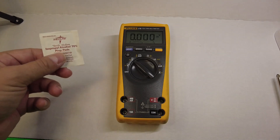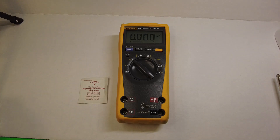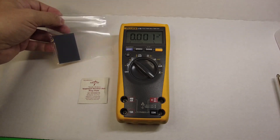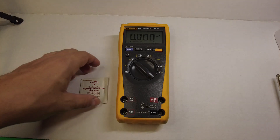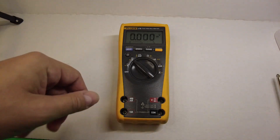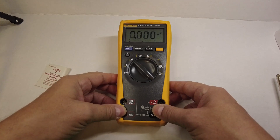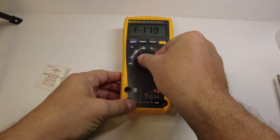I'm pretty sure it will restore the display. So if you're looking for a quick fix, this quick fix may last a month, it may last a year, but eventually you'll run into the same problem over time. When you get to the point where you no longer wish to clean the elastomeric connectors, the next way to fix it would be to replace them with the new gray style. This will work on the Fluke 175, the Fluke 177, and of course this one, the Fluke 179 true RMS multimeter.